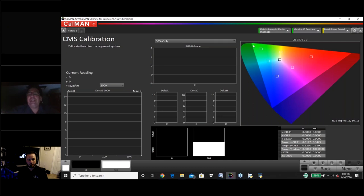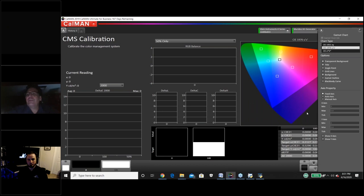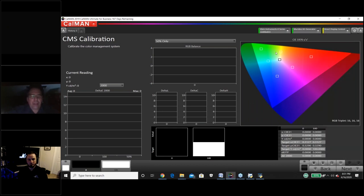So we can see here on the CIE chart, we have Rec 2020, which is huge. None of these displays can get to Rec 2020. What happens in mastering is you have the Dolby Vision monitor, the Sony X300, they do DCI P3 as the color space. So they're mastering in a DCI size triangle. I can't show it on these properties. But they are manipulating colors within the DCI spec, but outputting it in a 2020 signal. So even though the signaling can go all the way out to these far edges, they're only working within the colors of the DCI color space.